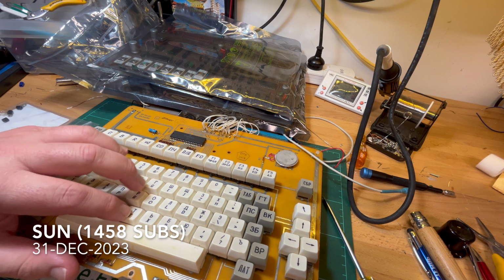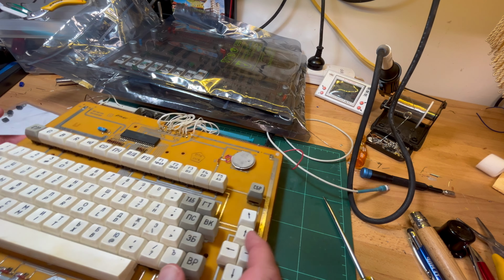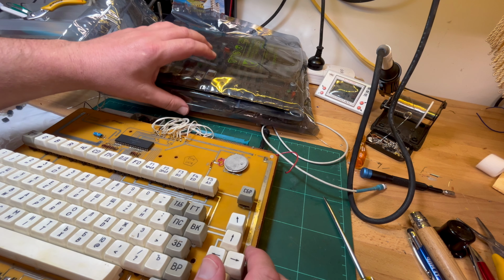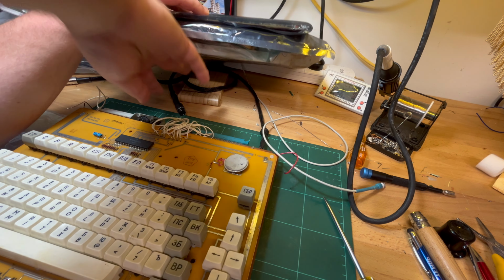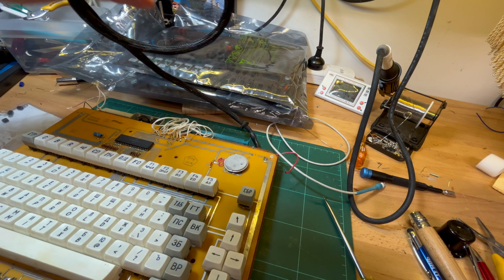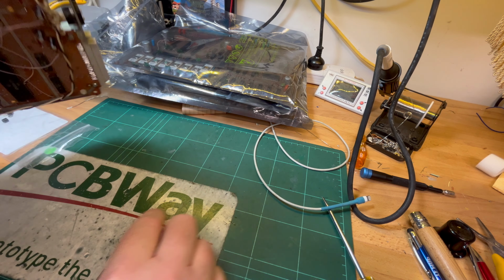I got some feedback on the forum about a possible reason why the Lviv isn't booting. Basically, an issue with the ROM, or ROMs. The idea is that BASIC isn't even starting. So, same issue with the ROMs.